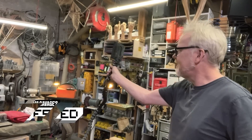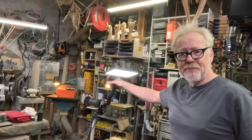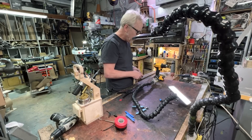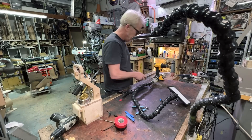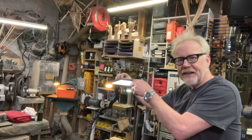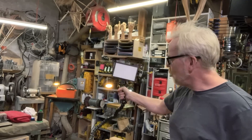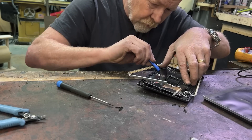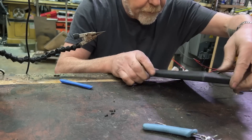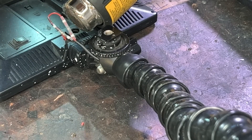When you come up with your own solution for workshop infrastructure problems, it's pretty common that you'll eventually have some shortcomings over time. Adam Savage is addressing a few of these with his workbench LED lights. The primary issue is that the barrel jacks for the external power have gotten a little loose over time, causing the lights to cut out when repositioning them. With a little bit of disassembly and soldering, he was able to bypass the jack entirely to have the lights directly hardwired. It's always good to take the time to improve your own tools from time to time.